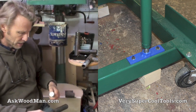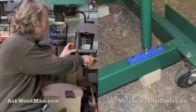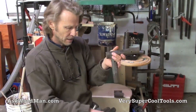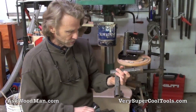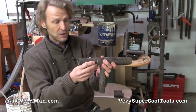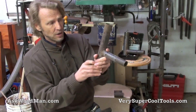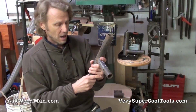I want to give you a little background on why I chose this. I use these all the time — I have a whole bunch of them throughout my shop. This is one and a quarter inch and this is one inch schedule 40 pipe, and as you'll see they just sleeve together beautifully — not too tight where they get bound, but just tight enough that they align right. If you weld a nut onto it, you can create a handle or a bolt that comes in here and pins and locks it just beautifully.